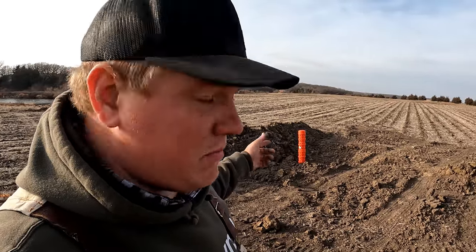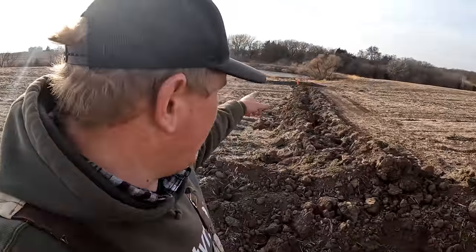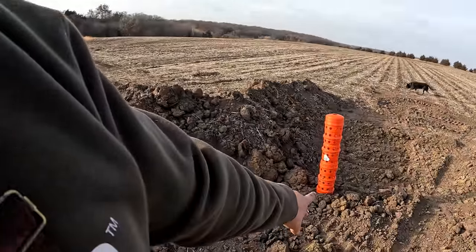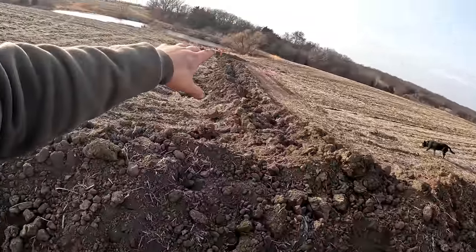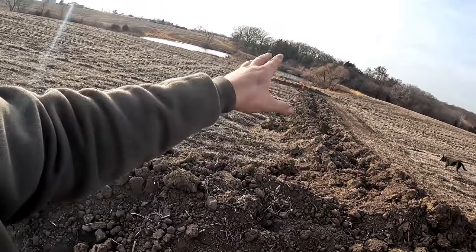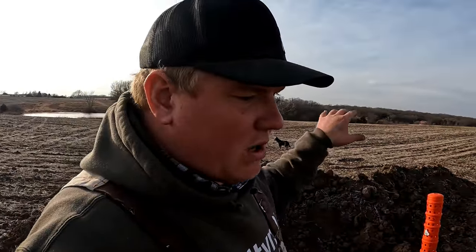We have hundreds of inlets that we take care of, and if there's ever an issue with them, we show up and fix it. So then the question is why does the government want you to spur it off versus not? So what can happen here, except for this is the top inlet, so they'd be really wanting me to spur off this bottom inlet because the top inlet's not really an issue. Basically, because this inlet right here is higher up than that inlet down there, if you had a bunch of water right here, it causes a hydraulic pressure, and they could see that as a relief valve, and so water could push up out of that inlet down there and kind of bubble up. If you watched my pond overflowing video, when the water starts running down the overflow tube, there's a hole down there in the bottom, and it'll shoot water up out of there if it starts running down the hill really fast.